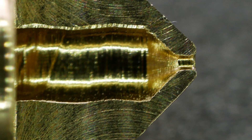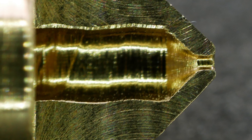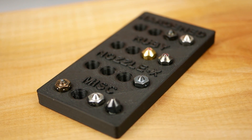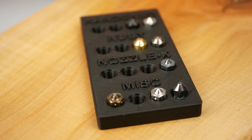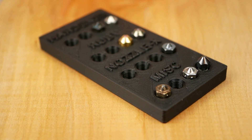If you don't want to risk that, buy genuine E3D nozzles or from some other reputable manufacturer. For not worrying about nozzle wear at all, get yourself a wear-resistant nozzle — be it hardened steel, ruby, tungsten carbide, or whatever — and this is actually something I'm planning to test in one of the next videos. So stay tuned for that!